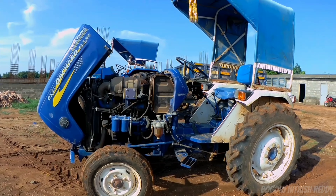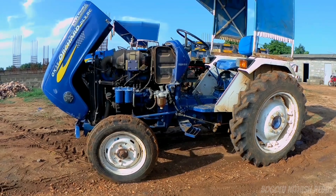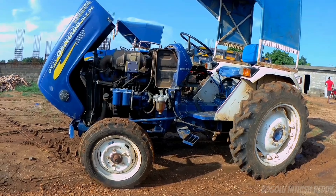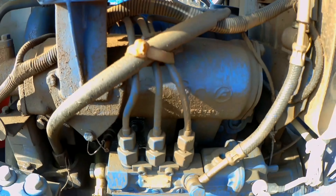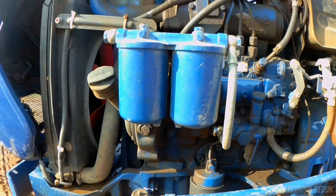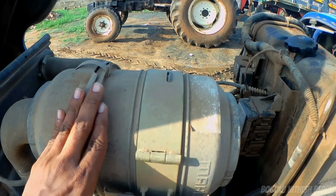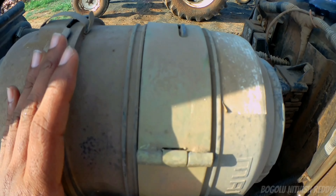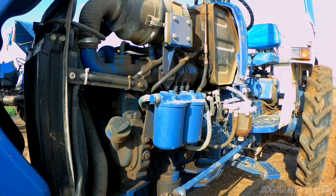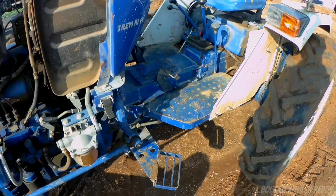The cooling system is water cooling. Engine lubrication is force-fed and splash type. Engine oil capacity is 5.4 to 6.0 litres, and coolant capacity is 7 litres. The fuel injection pump is a Bosch mechanical type with centrifugal variable speed governor. Air cleaner is dry type. Fuel tank capacity is 20 litres.